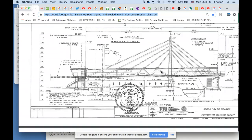What I can make happen, though, is you putting compression in this member, and it's resolving itself while being surrounded by concrete, the number 8 rebar, let's call it. Once that compression started dialing up, I can see it buckling the rebar and cracking this in a beautiful way, showing that crack in here. Now that was making all the loads under equilibrium go down 10. So talk about my lovely equilibrium.